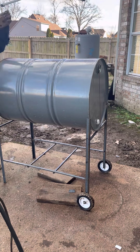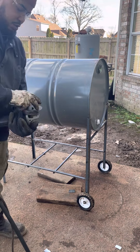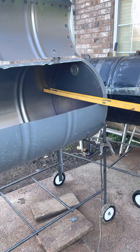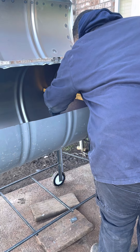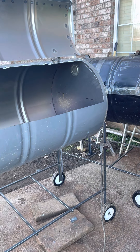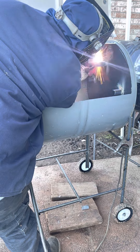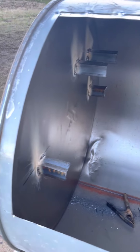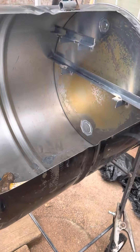Door number two — same way with my little pop string. Love that pop string. We're gonna bust open a new grinder, put them lips on ASAP. Got both sets on now, we're gonna put the racks in. You just want to level it straight to the back, make sure your level is sitting in the middle, and make two marks at the bottom. You want to mark them at the bottom because you want it to sit flush with the door. I put two on the bottom and two up top, and you can still weld them to the barrel itself. Assembly line, baby.